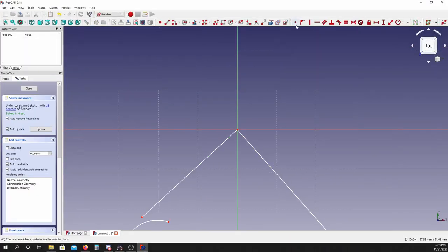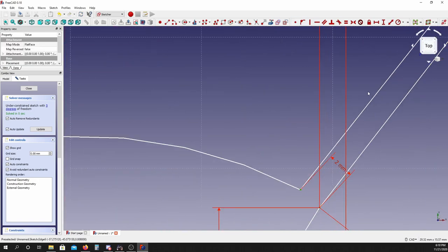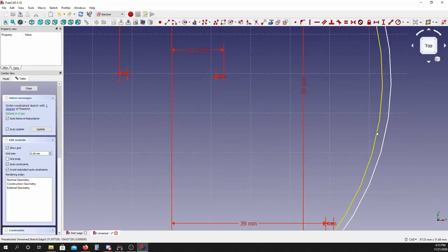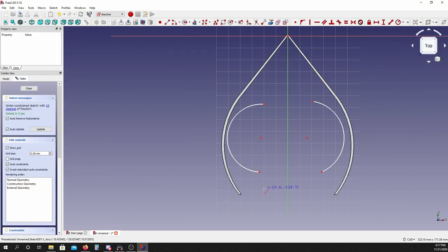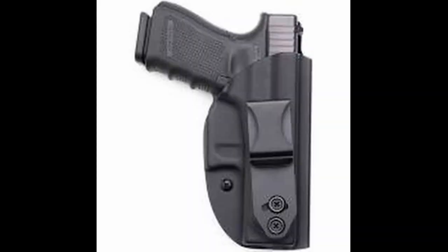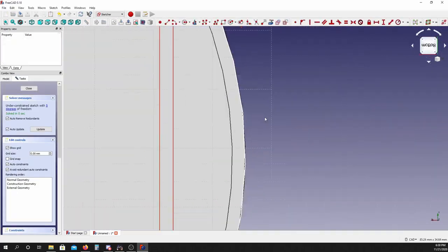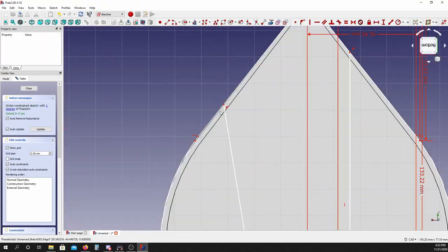Something else that IBBY-06 left in their designs is a sheath for the knife. It's a pretty interesting shape for a knife sheath and would be very difficult. The sheath shown has some issues — the tip of the knife would break it, so it needs to be redesigned. For this sheath we decided to go with the simplest common denominator: a spade shape that covers the entire back of the knife, with edges down towards the bottom past the point where the curvature starts to neck in. Hopefully the flexibility of PETG will create a kydex-like grip that will clip the knife in naturally and won't need much external force. There are also a couple of little loops on the back to allow string attachments.